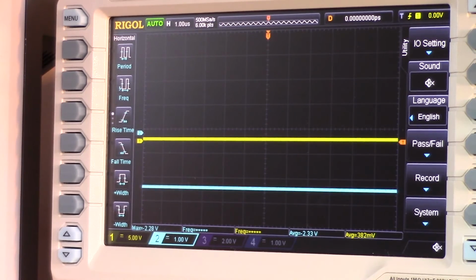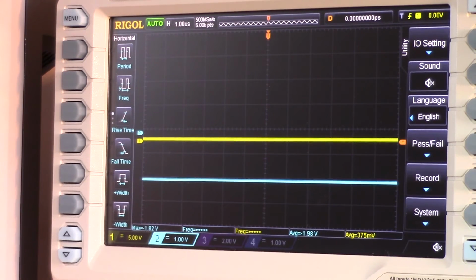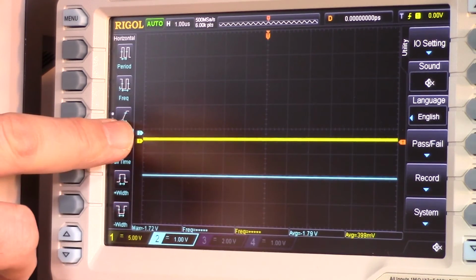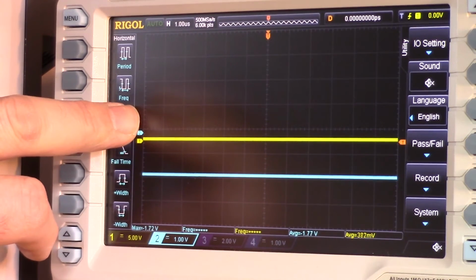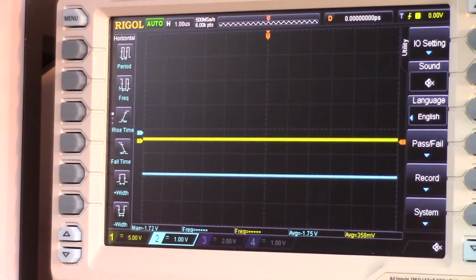Now what I haven't done yet is calibrate how much this line moves up or down on the solution. I need some properly calibrated buffer solutions for that. My pH pen tells us that we've now got a reading of around 4 down here. 7's in the middle, 8 was up there, so we're running about 8, 7, 6, 5, 4. We're running about 600 millivolts per pH difference currently. Well, that's about it, folks. That's about all I can tell you about pH probes.